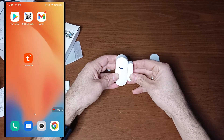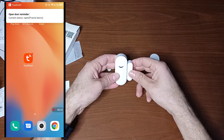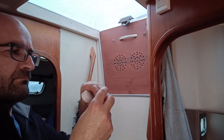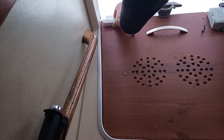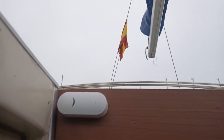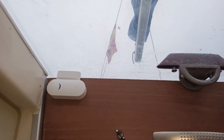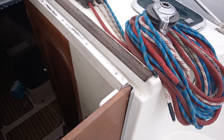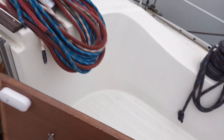Its operation is very simple. As long as the magnet is next to the sensor, everything is calm and the door is closed. When they separate, we will receive an alert on our phone that the door has opened, and when they come back together the app will log the time the door was closed. It only sends a notification when it opens; when it closes it simply gets logged. Once we've confirmed it works, we'll install it in its place — on any door, hatch, or port we want to monitor. We are going to install it on the boat's entrance door, using the double-sided tape that comes with the device. We simply need to be careful to align the arrow on the sensor with the arrow on the magnet.